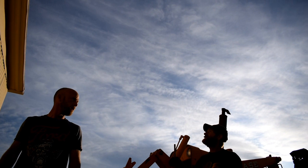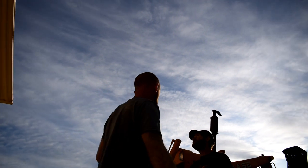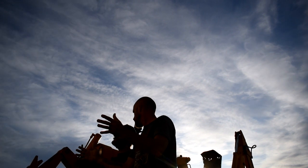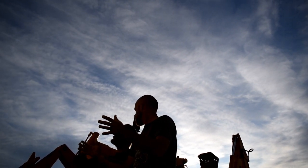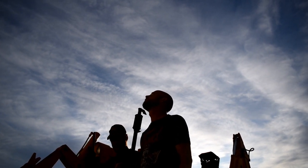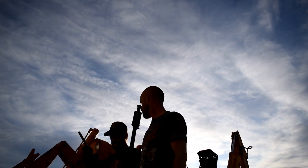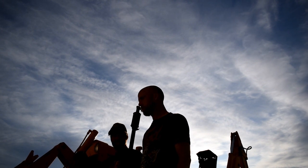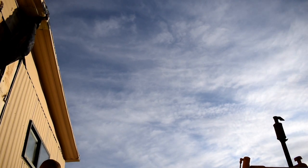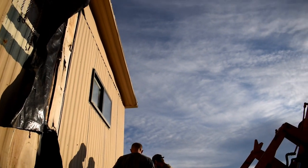That's better. And like I said, once we pull them lags together, it'll stretch that roof too. Right. Because that roof released tension. So, okay. Once we draw it tight, it'll bring that tin tight too. Are we gonna go up there and draw them together today? You wanna do that? We have time. Let's get it done. We'll just run them lags back in the same hole. 9/16, I think is what it was. There's one bolt. Rest of them are in there.